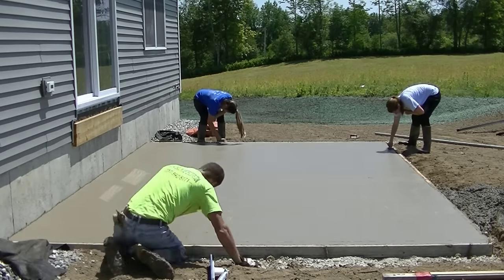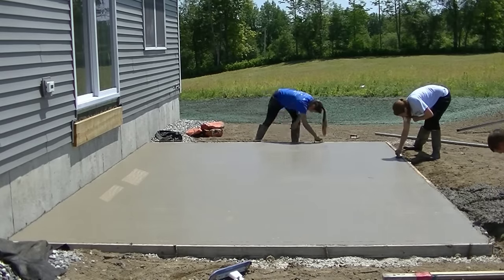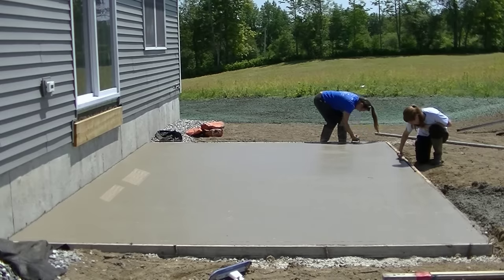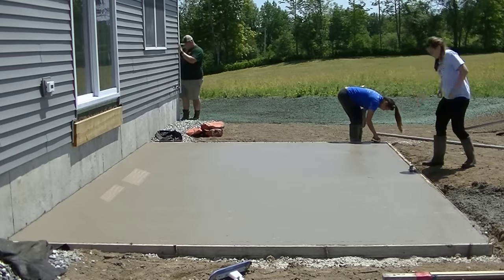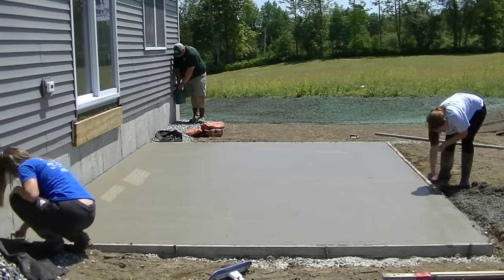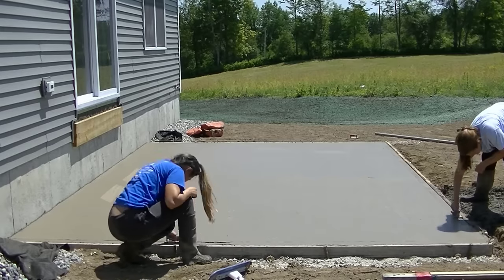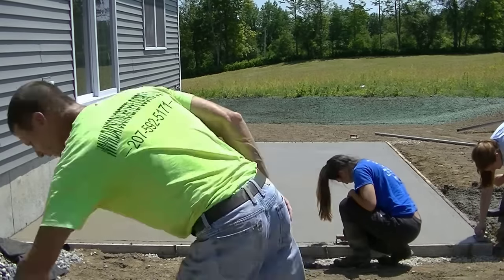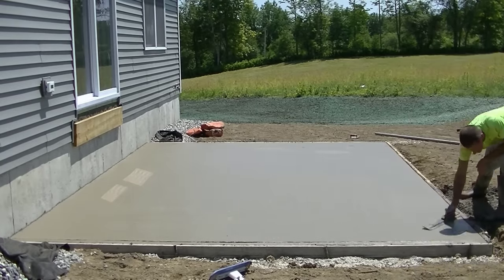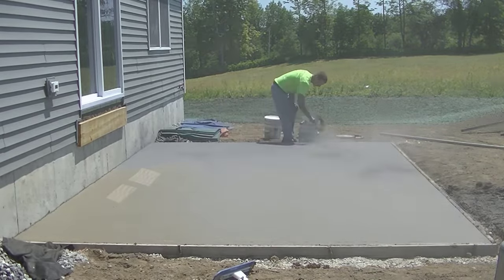This was our second pour of the day — we poured a big house floor first and left Luke and Darren on that to finish it. Because we've been battling rain, we had to come up and get this thing done. So I got Abby and Tia putting the edge on it around that outside edge. I'm going out front to get my truck with the stamps and backing around back so we don't have to lug the stamps too far. We had just enough time to go get the truck and get back. Now I'm magging out their edge mark but leaving the rounded part right by the board, and I'm getting right back on this thing now — it's ready to go.